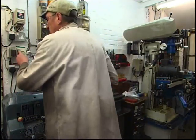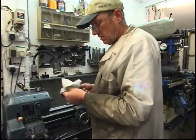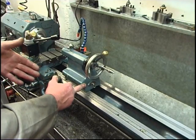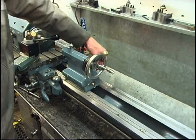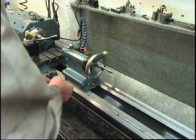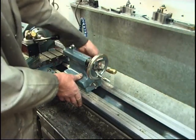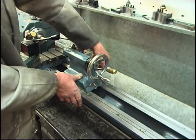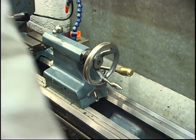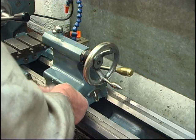Put my centre back in. Now what I did before I set the tailstock over, I put a paint marker in to make it easier for you to see. So what we'll have to do, we'll have to line the paint mark up again, which is going to get the tailstock somewhere near. See it moving there - this will get it somewhere near, and then we'll use a clock gauge to set it up spot on. I've got the paint mark lined up, which means that the tailstock will be somewhere near the centre - it'll not be right but it'll be very near.